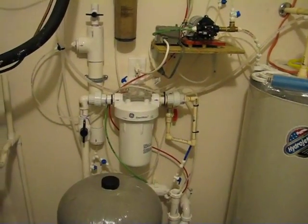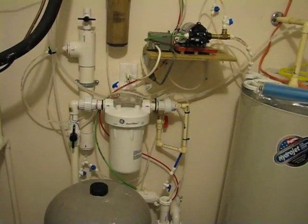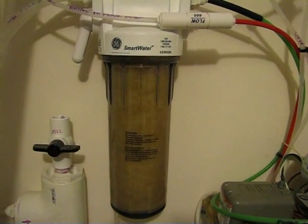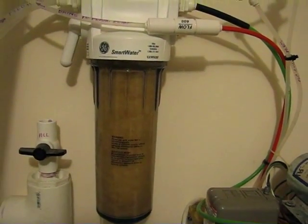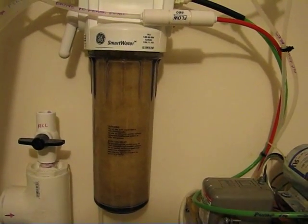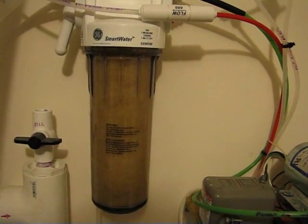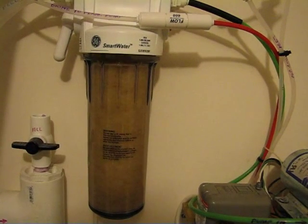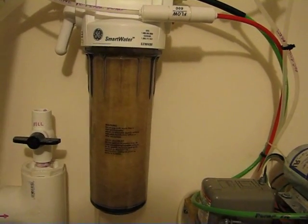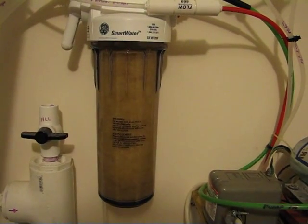When adapted to a whole house, this system does have one important modification that I'll cover when we get to it. First, let's go through the basic identification of components as they sit on the wall. This first canister is the pre-filter — it takes out the big particulates, so we don't clog the membrane with sand and sediment. The membrane produces a fixed amount of water, and as we push water through it, it slowly plugs up just like a screen, getting clogged and taking longer and longer to generate water. So the pre-filter takes out the big stuff.